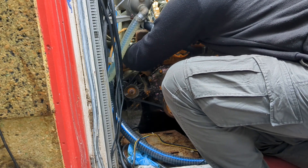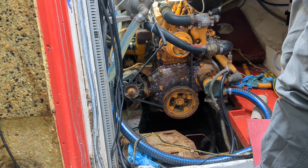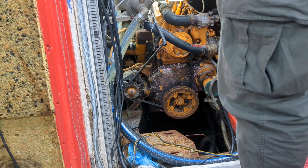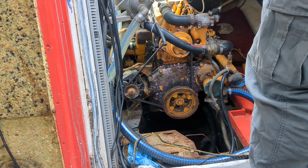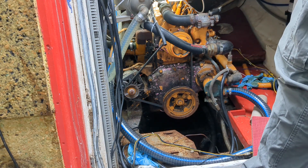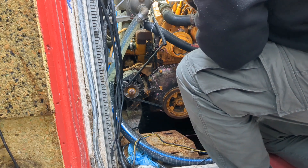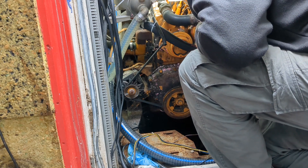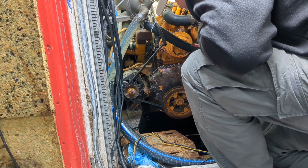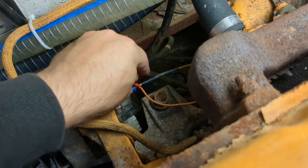What you clearly can't see me doing here is checking the connectors on the back of the alternator. The electrical diagram of the engine says that there should be three of them — a positive, negative, and a signal wire. I'm not entirely sure what this signal wire is for, but possibly to disconnect the alternator until the engine is actually running, so as to not add additional force for the starter motor to overcome. So I disconnected the red wire — the live one — since I didn't need the alternator to make any power. These old diesel engines run without electricity once they're started, and as long as Ophelia is tied up I could just charge the battery from shore power. This should prevent the alternator from generating too much drag for the starter to overcome.